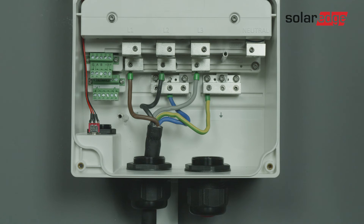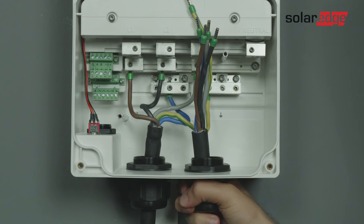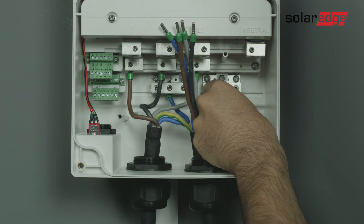The load neutral should be connected according to your local grid regulation. In the case that, in a backup event, it is required to make a local short between neutral and protective earth in order to create local PEN — for example on TNS and TT topologies — connect the neutral to the top right neutral terminal. In case it is required to continue the supplied grid PEN, connect the load neutral to the lower neutral terminal block. In any case, please consult your local grid operator for their recommended connection. In the example shown, it is required to make a short between neutral and protective earth, so we will connect the neutral to the upper right terminal. Now open the load gland and insert the load cable. As with the grid cable, you should also connect the ground wire first.